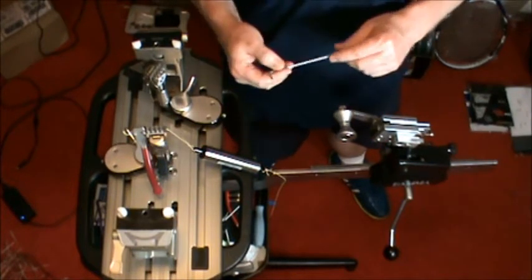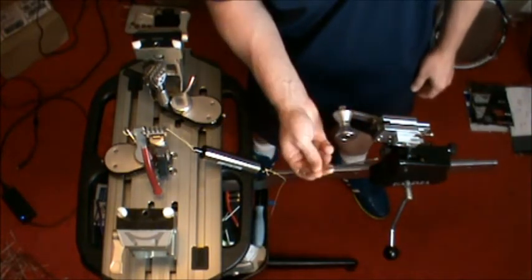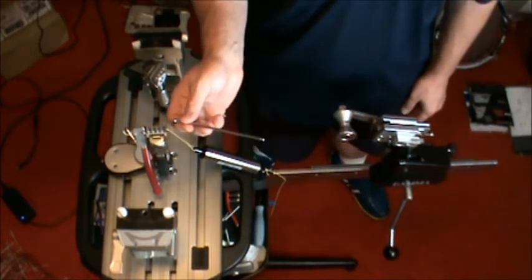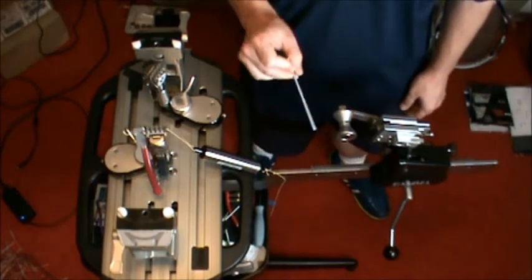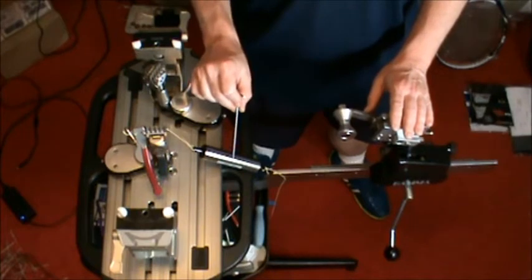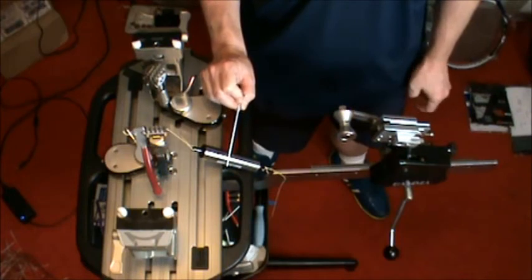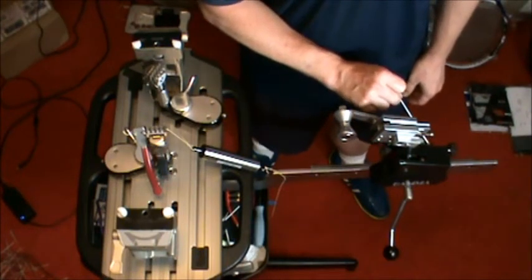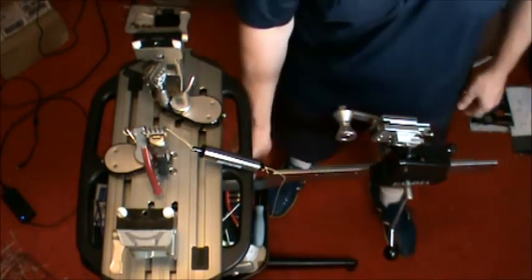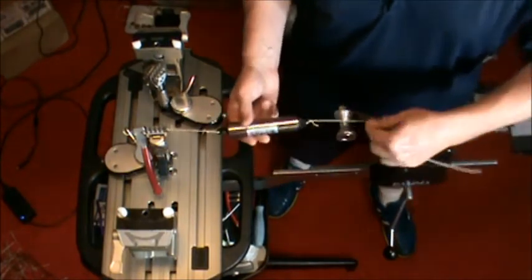Now what I've done is I've intentionally taken my crank out of calibration. So I used that 3mm hex wrench and I turned this adjustment screw clockwise, which made the tension go down. In other words, even though this is still set at 40 pounds, this is going to read something less than 40 pounds. If you turn this clockwise, it's going to make the calibrator reading less. The real tension will be less than what it's set over here on your dial. And if you turn it counterclockwise, it'll do the opposite. So before I show you how to adjust it, let's go ahead and pull tension here and see.